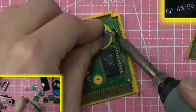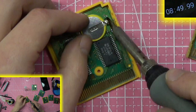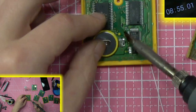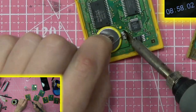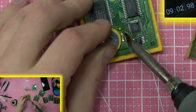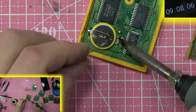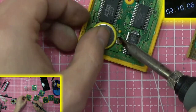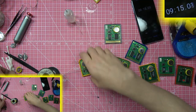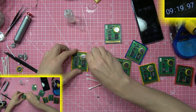If I did it the fast first way — like 30 seconds per cartridge — this video would have been over so fast. Oh, that one's not lined up perfectly — gotta reflow it, smudge it back in, recenter it. It's all about getting a really nice flow on the solder joints. Not too much heat, not too little heat — gotta get the nice melt. That was our eighth battery.